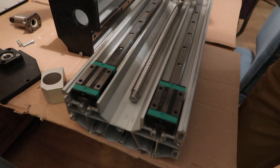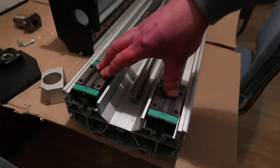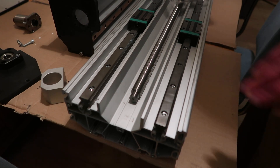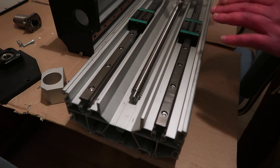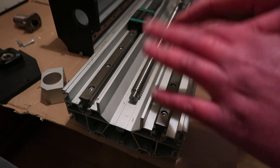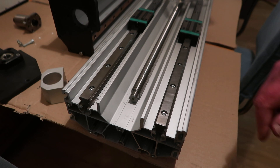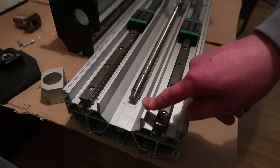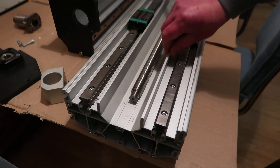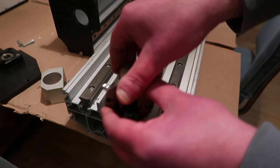I asked Felder if they'd done this or how they did it — no reply yet, so I guess they never tried adding a grease nipple to the ball screw. The problem is, once the whole machine is assembled, there's no way to reach that nipple. If it were at the front I might access it through a hole in the mating part, but as it is now it runs around against this piece. I could machine it away, or use a grinder — not ideal — or maybe put it on the CNC machine.